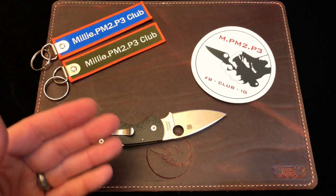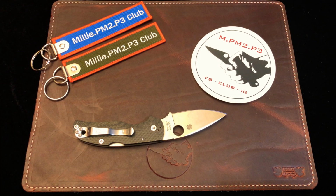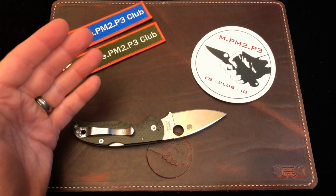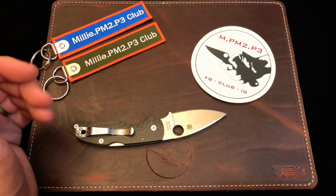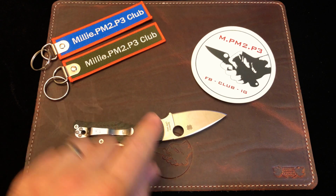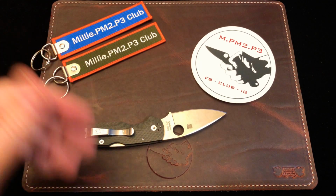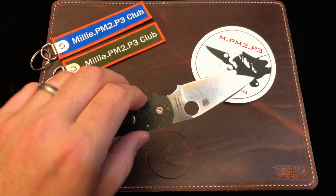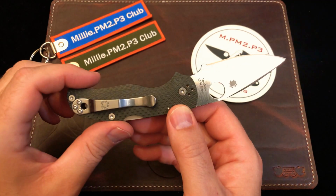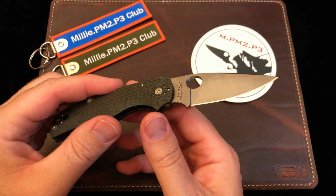It just is. It has the most carbides. It's finicky about what kinds of stones you need to use on it. It's immune to non-diamond stones, so it's actually somewhat difficult to sharpen without a diamond stone. So you add all those things up, that's my point. It's a little bit harder to maintain. The S90V is not quite as insane, and it's something that you can maintain a lot easier, in my experience. It is also a stainless steel, so you don't have to worry about the knife changing color on you, or rusting, or showing patina. It's going to be much more resistant to all of those things.